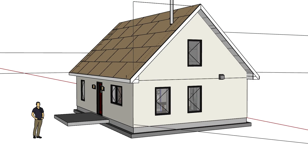We typically like to orient the bedrooms with east light to illuminate the space with morning sunshine. In the same respect, we try to find trees that will cast shade from the west to minimize overheating during the late hours of summer days. We also make sure to provide daylighting to the workspaces. Living in a house with good views can be inspiring — in fact, the views sometimes completely dictate how we orient the building altogether. These are just some of the considerations we make in creating a beautiful design that functions well.